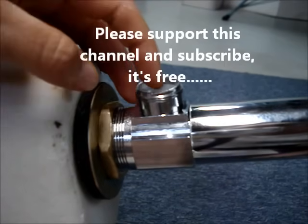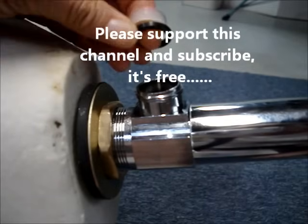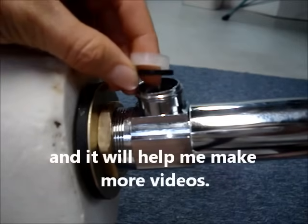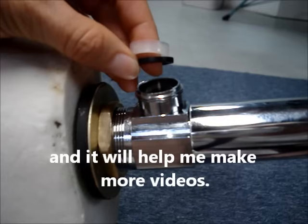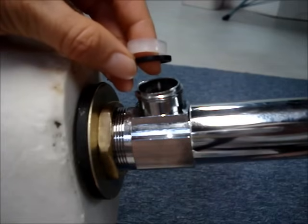Be careful when you remove the pivot rod, especially on the metal drains. There may be small pieces inside, and you want to put them back in the proper place and order when you reassemble the pivot rod.